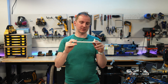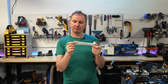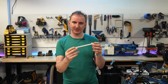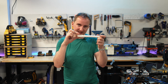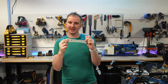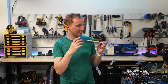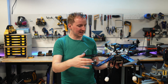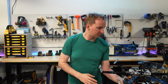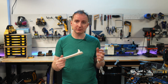Some of these plastics aren't perfect, but I do think this nylon one with glass fibre is definitely strong enough to go forward. I'm going to make a few design changes — add some reinforcement on the bottom and generally improve things. With the potential Y6 configuration, I need a motor on the top and bottom, so I need to make the motor mount disc a little bigger to accommodate that. Essentially I'll take roughly this design, shorten it, change it a bit, and then make some frame plates. I'll need to make the plates in the middle that join the frame together and some landing gear as well. Next time we'll look at what it takes to assemble and add components to a 3D printed drone frame.